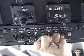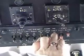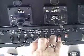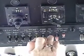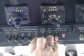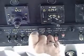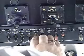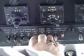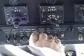So we'll engage the starter switch, turning the engine over. The co-pilot, because the pilot can't see it, is counting the number of blades that pass in the propeller rotation. So he counts 8 blades. While those blades are being counted, we give one quick shot of prime as he counts each blade. 1, 2, 3, 4, 5, 6, 7, 8, 9, 10, 11, 12.